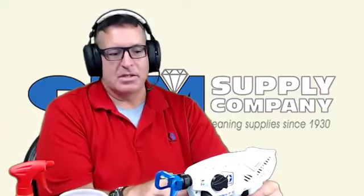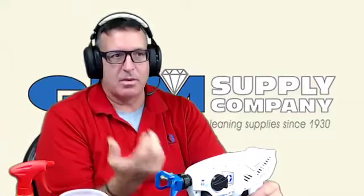The one thing that's important though is we don't want you to squeeze the trigger when there's no chemical or water going through the system. We don't want to dry run it, because the fluid is the coolant and the lubricant for the whole pumping system. That's where we could run into trouble, if we just pick it up and start squeezing the trigger and there's no water or disinfectant in the unit. So you definitely want to be aware of that. But other than that, it's very simple to use.